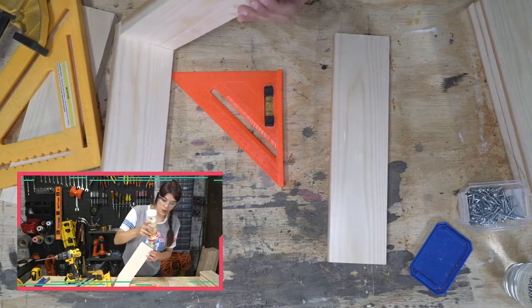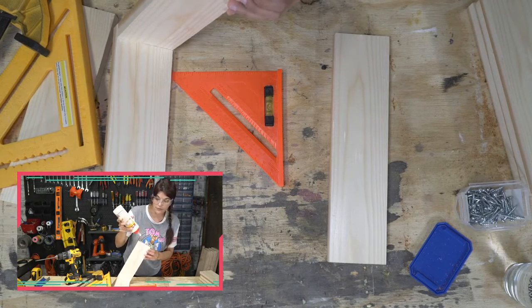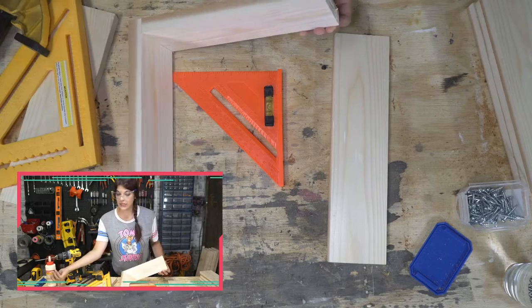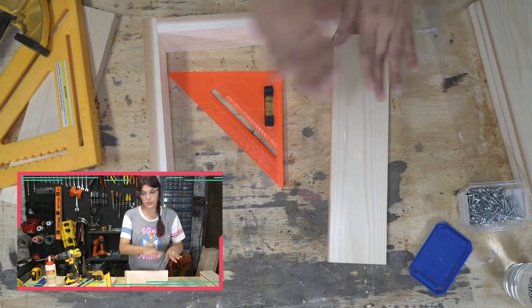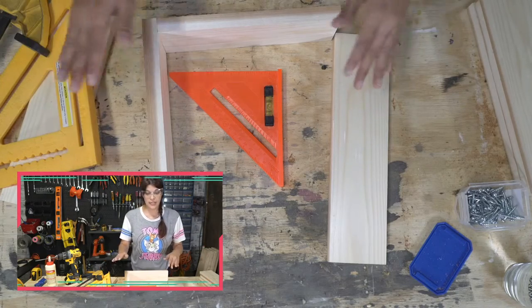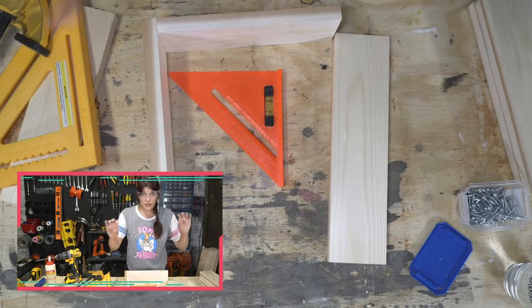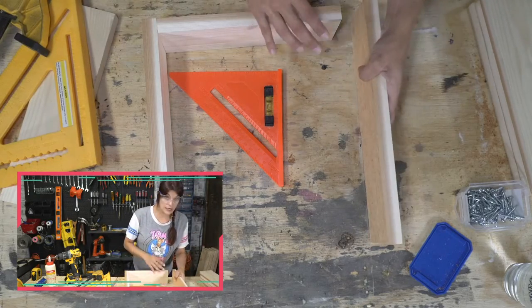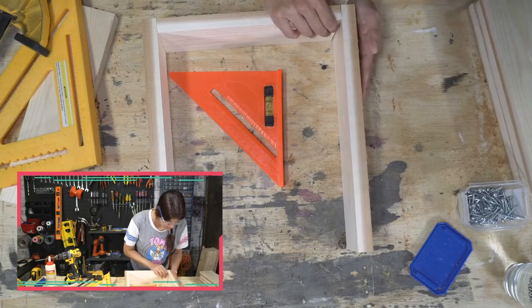So Anas is saying 4 inches is a lot. It is a lot. It's very frustrating trying to build furniture in here. The workbench also slopes, of course, but at least I know the surface is straight. So oftentimes I have to put a piece of plywood down, shim it, and use a level to make sure that plywood is absolutely straight before I can build anything. So it is a little frustrating.